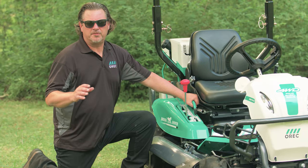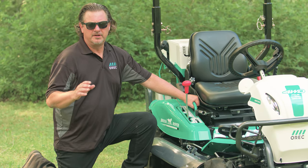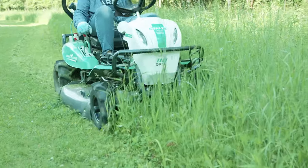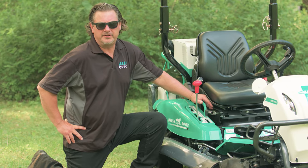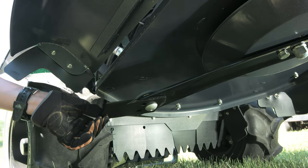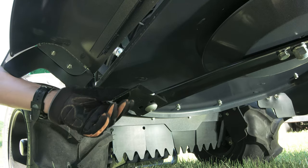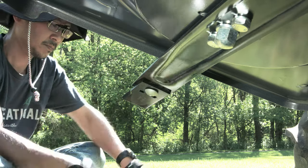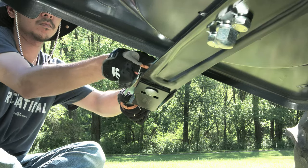By turning the debris into mulch, you can enjoy its benefits. That includes inhibiting future growth, enriching your soil, preventing moisture loss, and saving you the time and labor of collecting and removing the large debris simple rotary cutters will often leave behind. The unique design of the flail blades allows them to pivot when they encounter unexpected obstacles such as stumps and rocks to minimize damage to the Brush Rover. One more great benefit of our flail blades is that they have reversible sharpened edges, and when one side becomes worn out, the blades can be flipped for a new sharp edge.